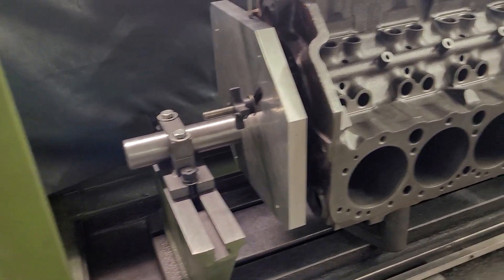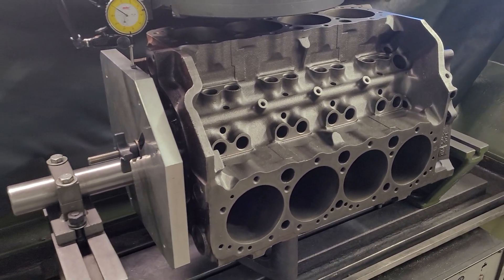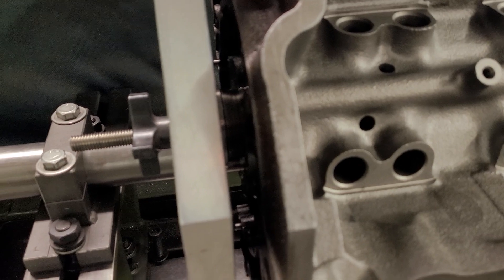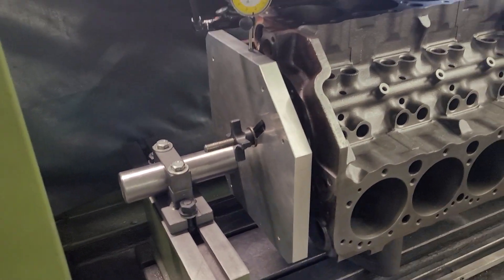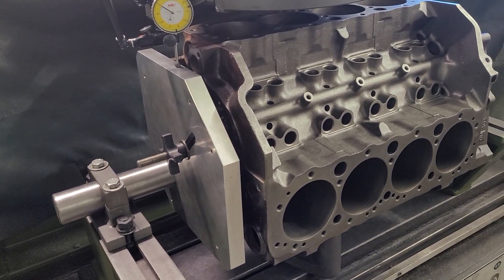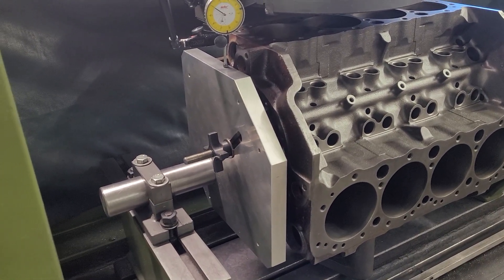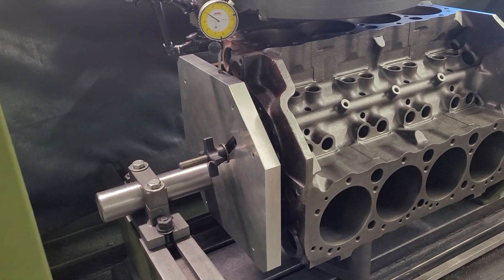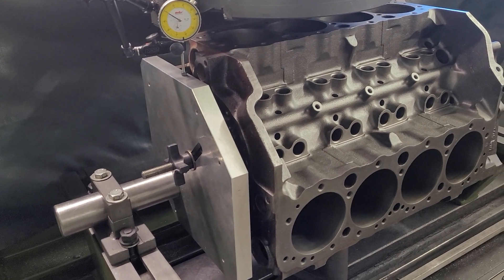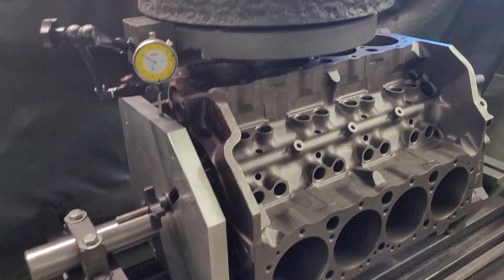This fixture here — the two-inch ground bar goes through locators on the mains after it's been line honed, and then there's a locator that goes off the cam bore. That plate is a precision plate that I made on a very expensive CNC at the time, used as a reference point. That gives me my angle correction and my height measurements to actually set the deck height to what it needs to be.